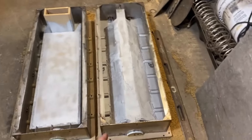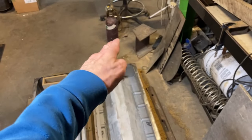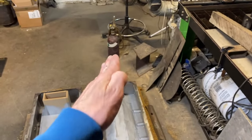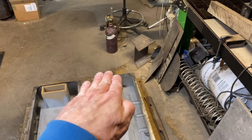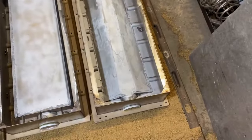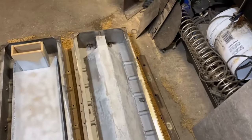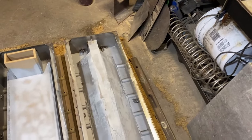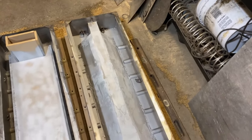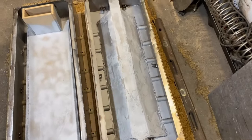Had to do a little bondo work to this trough because it has a curved plane. You can't put a straight panel through when one end has a different angle than the other — that requires the sheet to twist. We've got two different hips, just like when you're doing a roof with two different gable pitches. You can't combine two different gable pitches with a flat sheet without putting a hip in there, so we've got a hidden center hip slope in the middle.